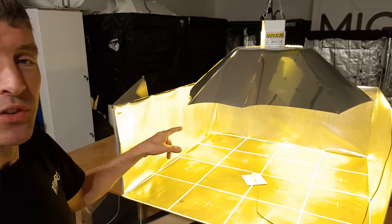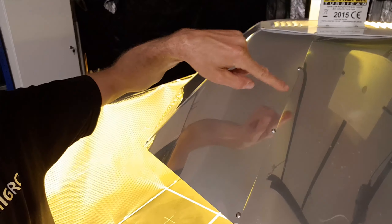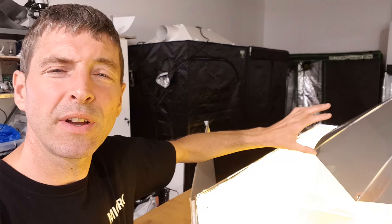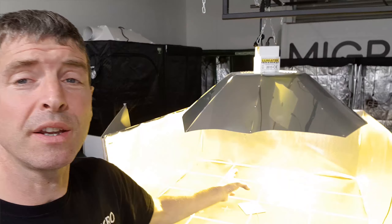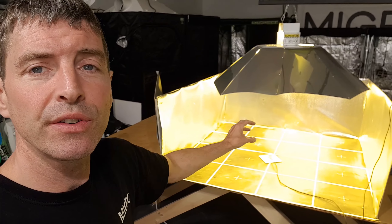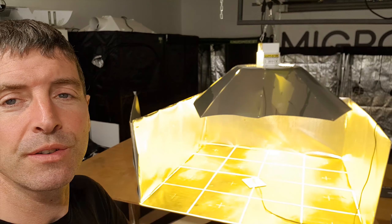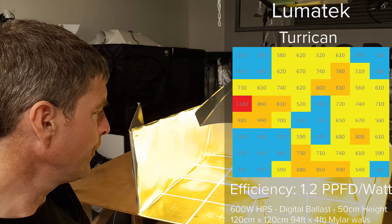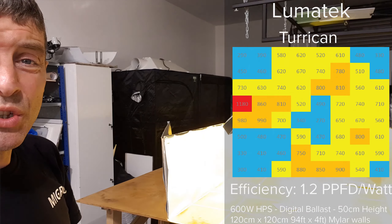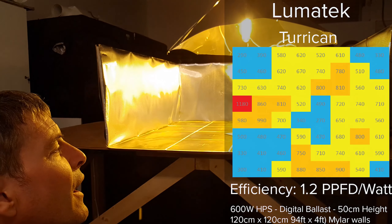The spread is reasonably even but when you assemble this thing together, even though all the screws are in and aligned pretty well, you still get a bit of unevenness around the edge — some panels bending outwards, some inwards. The light is not very even and you get hot spots around the edges, not so much in the center; it seems to minimize intensity in the center but gives intense spots around the edges, and they're not consistent. Not hugely impressed from a consistency point of view on the spread, and the efficiency is only 1.2 micromoles per watt.